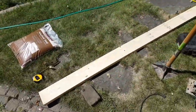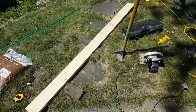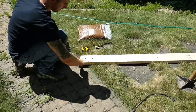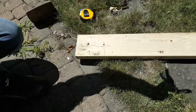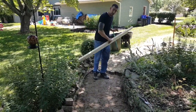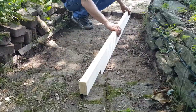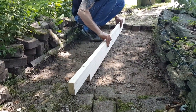We have our 2x6 and what we're gonna do is put a notch on this end and a notch on that end. I have a diagram on my blog post if you want to check it out — a diagram of how to cut your board. All we're gonna do is cut a notch on this board the thickness of the brick. That way when we put our board on the existing walk and go across, it will level the sand at the exact height that we want. This is the depth of a brick and you want to give yourself enough room so you can slide the board back and forth to create a flat surface. So we're just gonna check our surface and make sure there's no high spots, knock those down before we put down our sand. This space right here is gonna be our sand — it's gonna create the same pitch that already exists. You want to make sure your notches are cut long enough so that your board can easily slide back and forth to create a nice smooth surface.